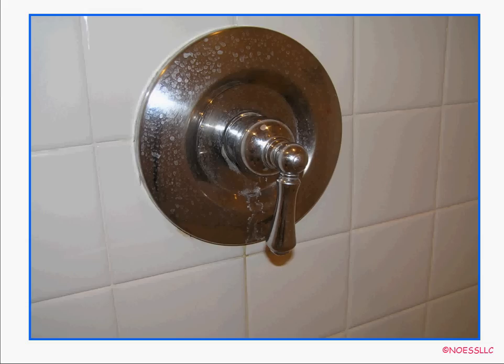This is the shower valve. You can see there's a little bit of discoloration here, but it's ten years old — our house is ten years old — so that's kind of to be expected. Water dribbles down here and you can see I've got hard water spots all over the place. The water here in Southern California and Orange County is pretty hard. It doesn't look too bad from the front, but the backside of this wall had some distortion in the baseboard, which indicated a leak. So I decided to take it apart.